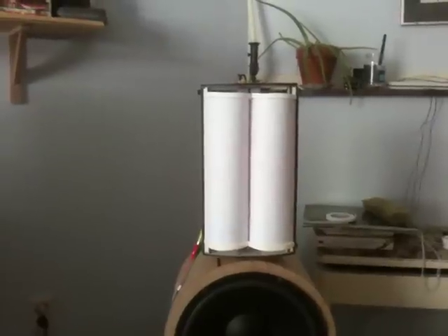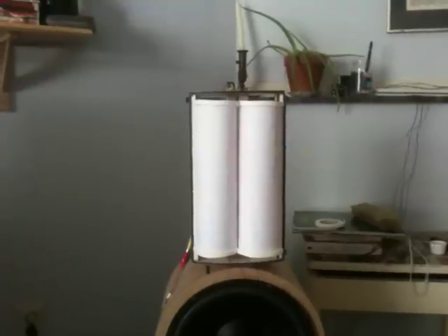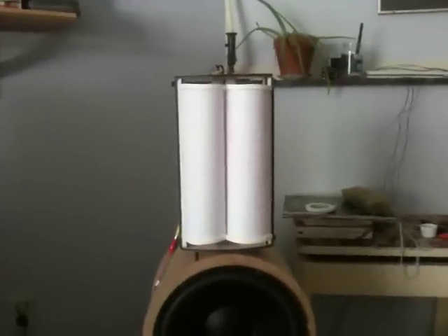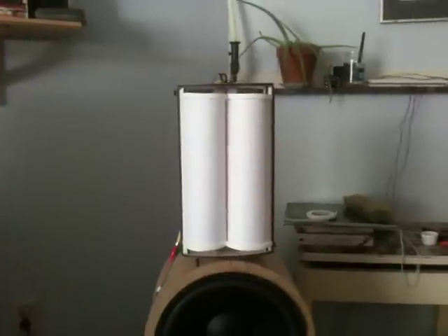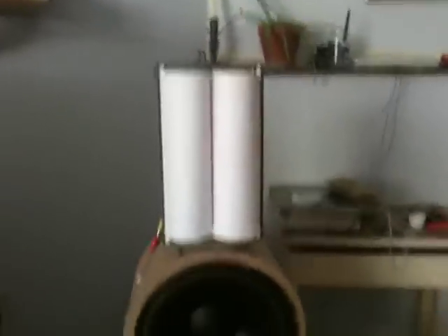And from 450Hz I think it was a plus gain of 3 or 4dB. Because there is no baffle as you can see, so if you put a baffle on it you will gain about 3dB from 500Hz and down. So this is the most inefficient method to use it — without a baffle. But for now, it will do.